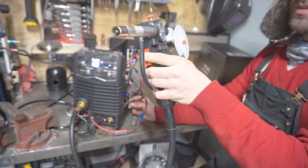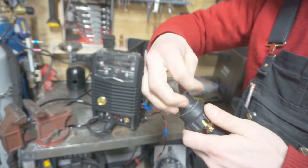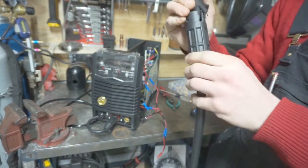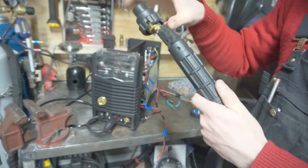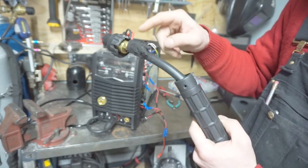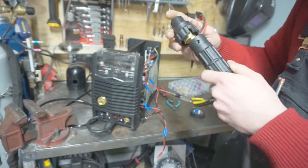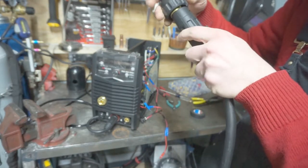It looks like this cheap spool gun is going to work. Here we have the end that connects to the welder — it comes with a nice little cap. Normally there are two wires that come out the back of the handle, but I thought if they came around in a loop that's kind of a hazard for getting pulled, so I cut a little notch here and here. It's just two wires going to a green and a red. I put red to red, black to green. I don't think you can damage it if you reverse them — since it's a DC motor it should just run in reverse. These connectors are overkill, but they're what I had with a quick disconnect, so I can mount that on the welder and have a snazzy little setup.